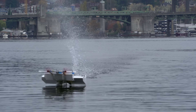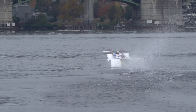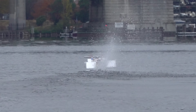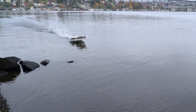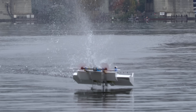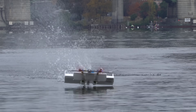This is basically the equivalent of increasing the gain on the controller a ton — so high that it acts like a bang-bang controller when the wand is near vertical, but gets more progressive as the wand comes up. You can see how the wand snaps forward when it comes out of the water and the canard deflects a ton. This seems super effective at keeping the nose down. Totally works — you can just see the canards holding it down; they move a lot and have a lot of throw. Keep in mind there is no electronic stabilization going on here at all, at least not on the pitch or roll axes. It's purely mechanical.